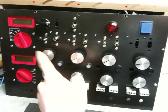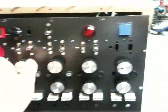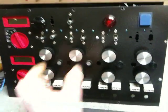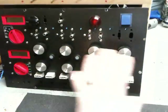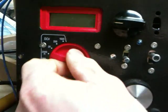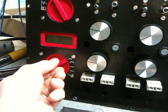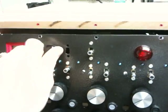This is for the voltage — the main voltage — and this is for the fine tune. There are four positions: one, two, three, and four. There are four individual power supplies in here and I can hook them together. Here's my voltage meter. I'll be able to switch it and put it on millivolts or higher. Same thing with my amperage — I can go real low or real high. And then this knob is for my voltages, where I'm taking my voltages from.